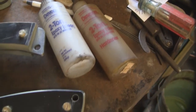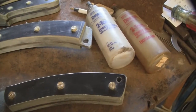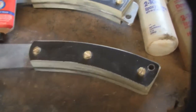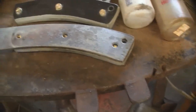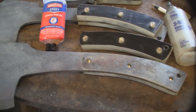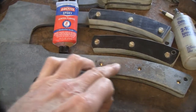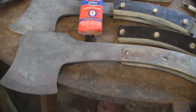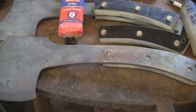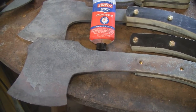That's a real good glue there. If you're bradding your pins on to the handle, you would want to use the two-ton — the slower-setting epoxy. I'll take these handles off now that I've got them mocked up like I want, and I can be rounding on those while I'm waiting on the blades to cool down from heat treat. I'll put them in a kitchen oven at 450 for an hour, and then soften just a little bit of the handle area later. Now I'm going to surface this with the 80-grit belt and clean that up before I heat it up in the propane forge to quench it in olive oil.